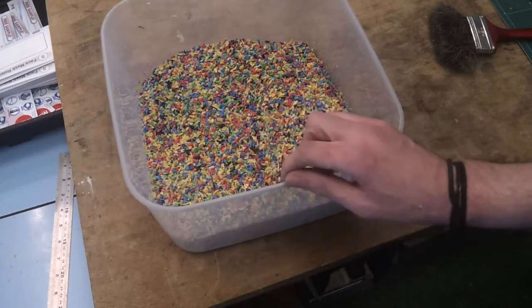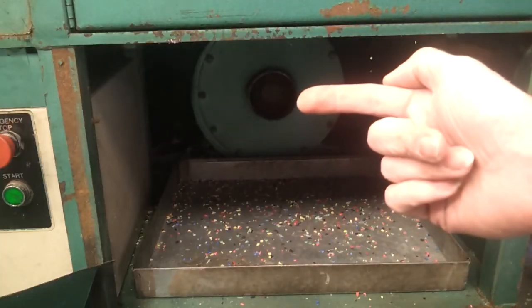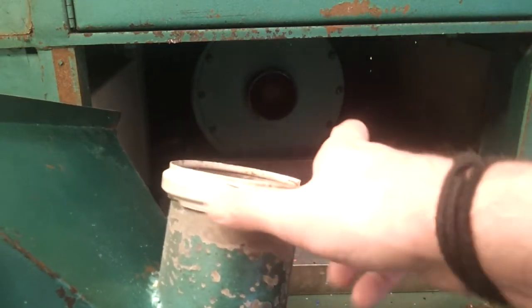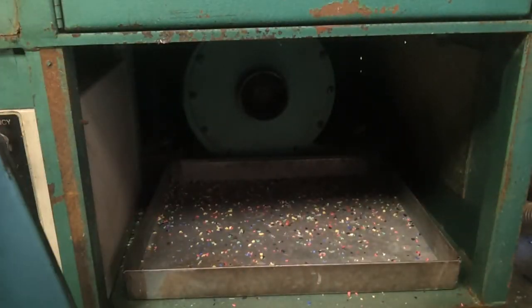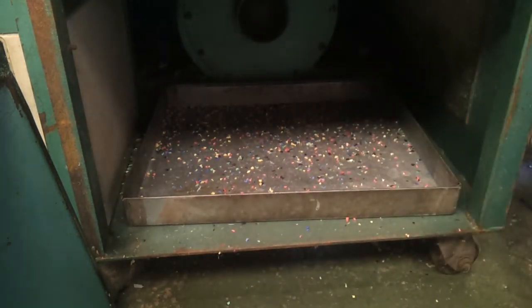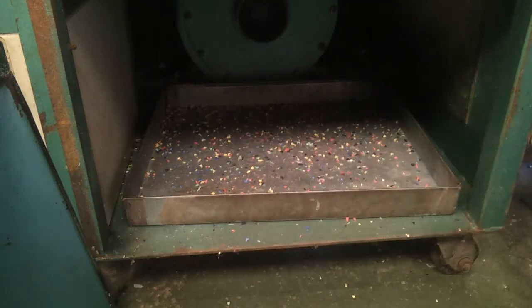Now I can show you the part of the machine which is hidden underneath, where it collects the plastic and feeds it through to the centrifugal blower — this bit here. There's a centrifugal fan in there which hooks onto the end of the receptacle with just a little toggle clamp, but I don't tend to use that, so I shut that exit off with a bit of tape. As a final touch I tend to put a tray under here just to collect any granules that come through. When I clean this out with a vacuum cleaner, I vacuum under there and all around here and in the tray itself, just to make sure I've got all the pieces so that the next batch isn't contaminated. So there's not a lot to these machines — they're quite well-built, sturdy machines, probably use quite a lot of electricity. This one is far bigger than what I need, but it's what I've got and that's how it works.